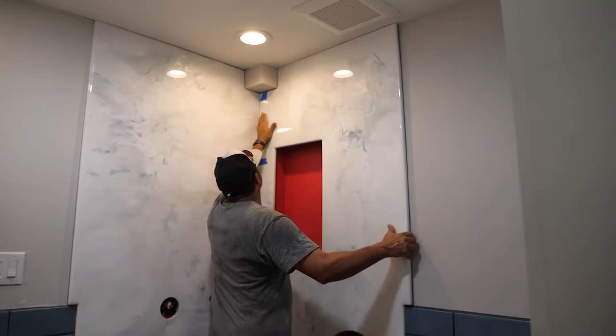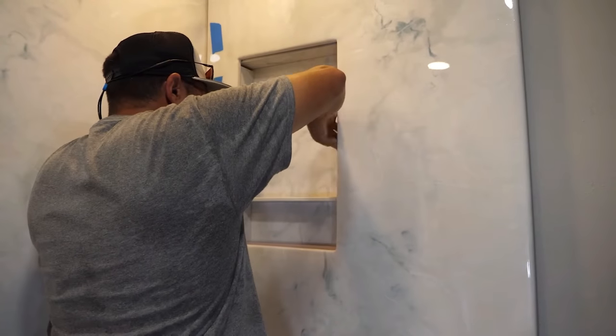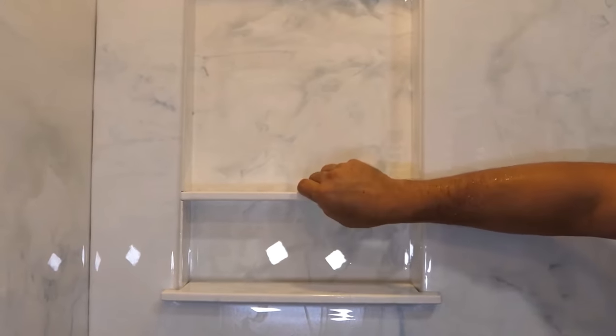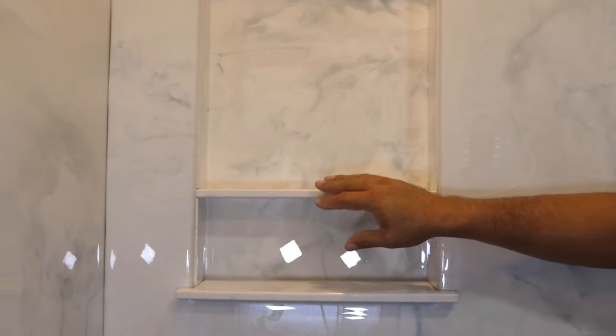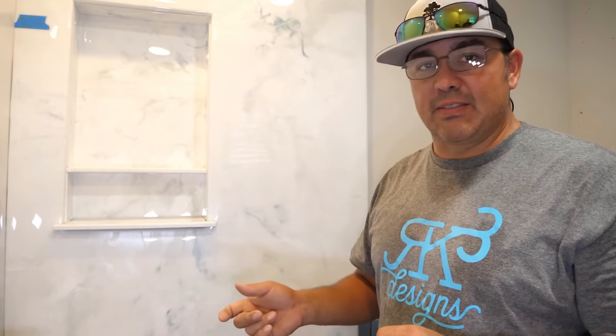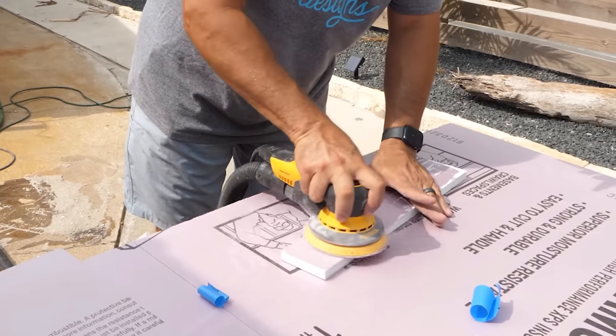Watch the pipe. With a little bit of red guard and the way we've shifted it over, we're going to sand the back edge of these pieces so it fits nice and flush. This is Med-X on this shelf — water-resistant MDF. If water hits it, it's not going to swell. We have pieces at our shop that have been outside, uncoated, for about six months and they look just like the day we put them out. We're sanding the back edge, kind of like planing it, so the reveals are equal. Using 120 grit and it's working just fine.